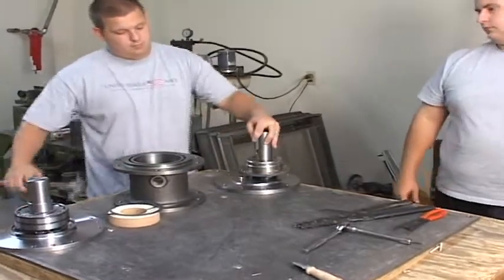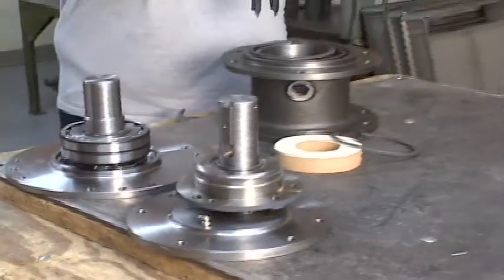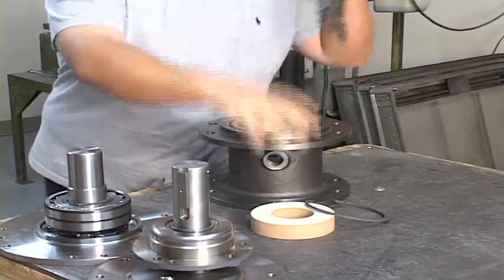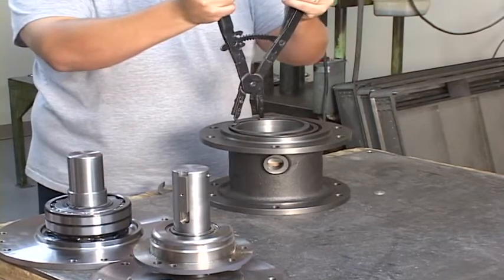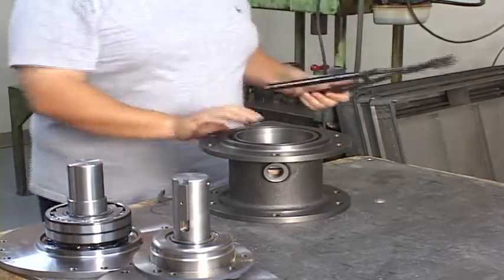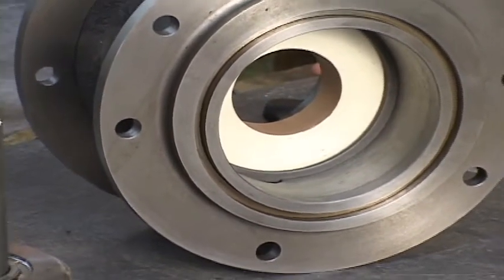We're going to insert the key. Then we're going to put the filler ring into the bearing housing. The filler ring is nothing but a piece of plastic that takes up space in the bearing housing, and what it does is eliminate the need for an extra tube of grease. A couple of changes we've made to the bearing housing: we now have a bearing plug that has a grease fitting in it, so it greases right to the upper bearing instead of pumping it in all the way from the bottom. We also have a half-inch taper so that you can start the bearing very smoothly and uniformly without getting it cocked.